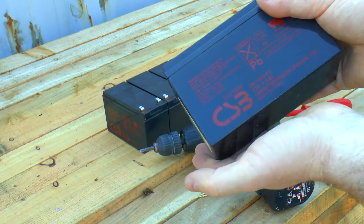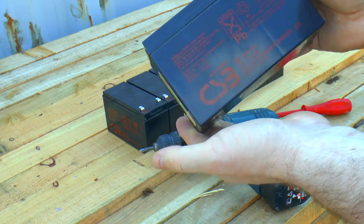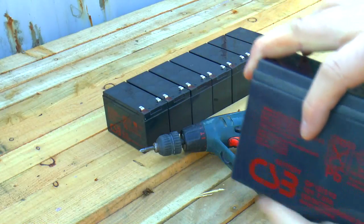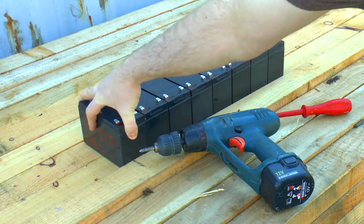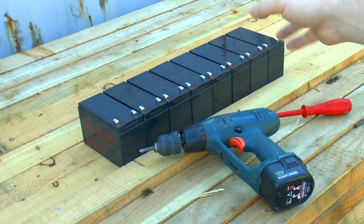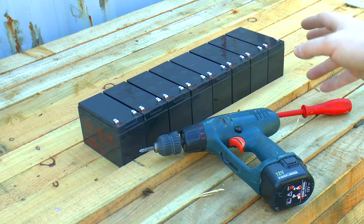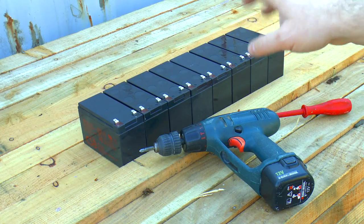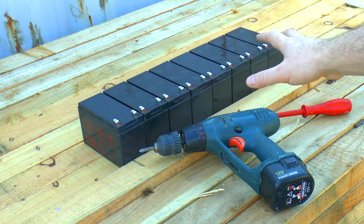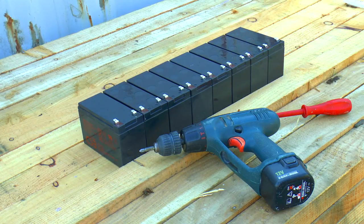You may decide you're not using CSB — maybe some budget brand will do. Well, suit yourself, but you may find they're not up to the job. You need eight of these for each unit, so that's 32 altogether. The price I've seen for 32 in April 2014 is a touch under 400 pounds including VAT — that's £12.49 per battery including VAT.